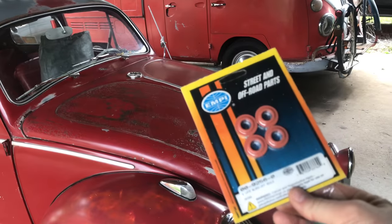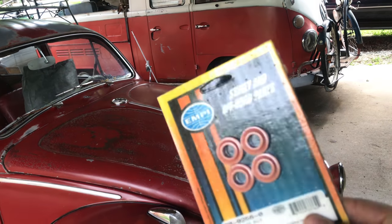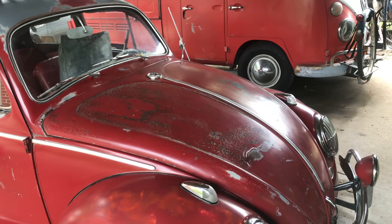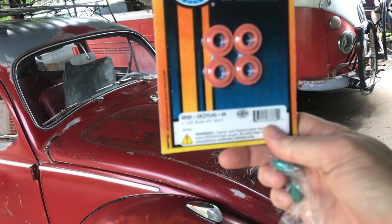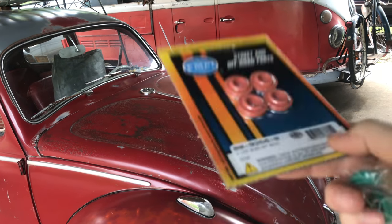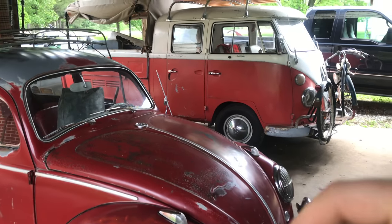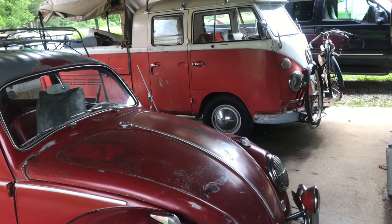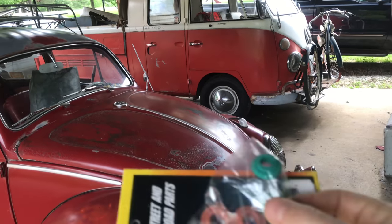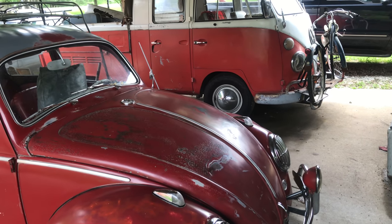Sadly, it's just these little pieces causing our issue. Davis Motorsport — Davis Racing in Morristown, Indiana — had them in stock. I went ahead and grabbed a set. The oil tower on older engines, like the old engine out of Pickle, is straight up and down, whereas these have an offset. So there are two different types of O-rings. I went ahead and got some backups for the other engines.